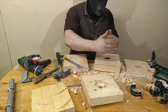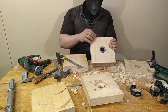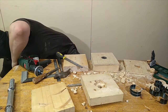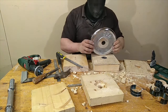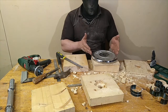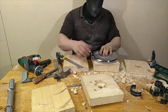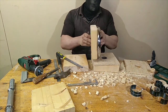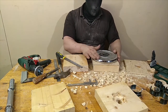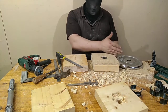You would still round this up. We want to make this so that at the end it is like an 8 sides. It will have 8 corners. We will still cut these out of it, because the weight plates, we do not want this thing to be further away than the weight plate. Because if it is, then when you are putting them on the plate, it will hit. You cannot turn it. So it has to be a little bit smaller profile than these plates that you are using on the dumbbells. So we still have to cut this on the profile.